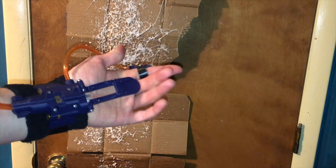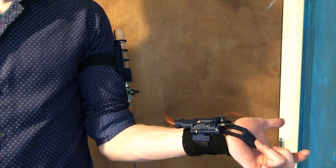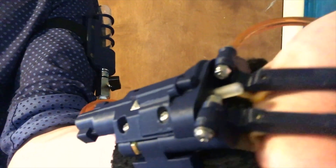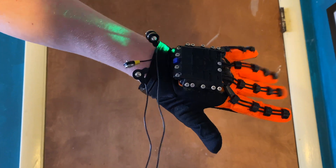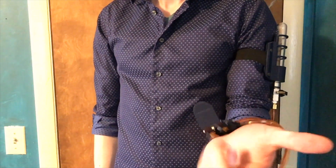One of the things I like about this web shooter is that the trigger can be deployed using a single hand. You have that nice finger switch around your index finger, and you can activate it with your thumb, which pulls the thread through the tube into the web shooter and retracts the trigger snap latch, releasing the trigger and allowing the elastic bands to pull it into your palm. Recently I'm using a more advanced solution to the palm trigger problem, but I always found this approach pretty elegant.